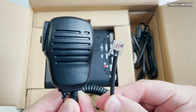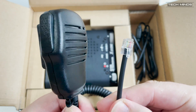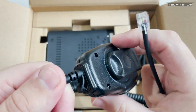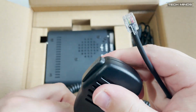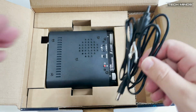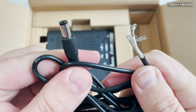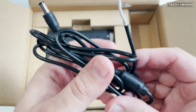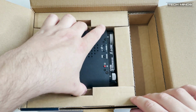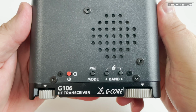So first off, what can this radio do? Well, it supports transmit from 80 meters up to 10 meters on the ham band. It can receive wide FM on the FM broadcast band, and its HF receive is from 0.55 to 30 megahertz. Now, supported modes of modulation on the ham bands are AM, SSB voice, and CW. There is no FM on this model, so no support for 10 meters FM operation.